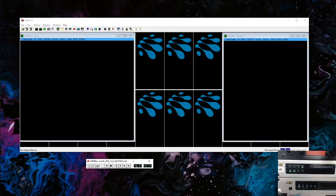On the front of the interface, you'll see the bottom two left lights on the Mio XL start to flash very quickly, almost solid, and that means it's loading the MIDI file and we're actually sending firmware to the interface. You can still see the alternating lights on the top while it's in bootloader mode.